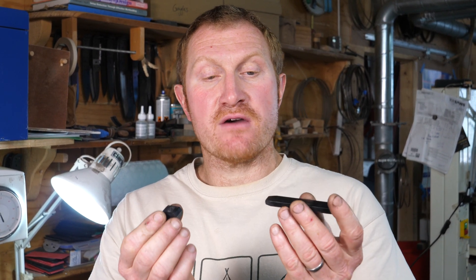To save a little bit of time, Chris makes the stamps for me out of O1 tool steel, and because there's sometimes a bit of a delay if he gets the heat treat done himself, he sends them down to me in a totally annealed form - totally soft - and then I can heat treat them in-house. O1 tool steel is a fairly common steel that I use for some of the knives and the carving tools, so I'm quite familiar with heat treating it.